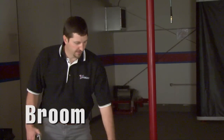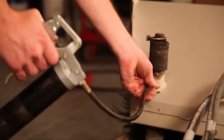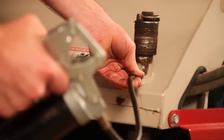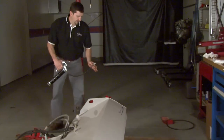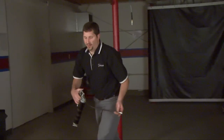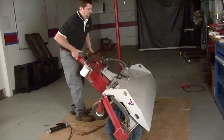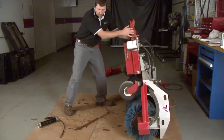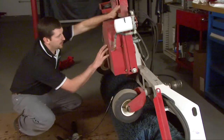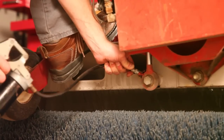On the broom, there are two grease zerks on the caster wheels — make sure to hit them with plenty of grease so they stay free. One on the right side and one on the left side. There's also the broom bristle pivot bearing to grease. The other two grease points are underneath on the cylinder, so you'll need to flip the unit up to get to those. One of them you cannot access without dropping down the hydraulic oil drum, but the main one you can — get that one greased good.